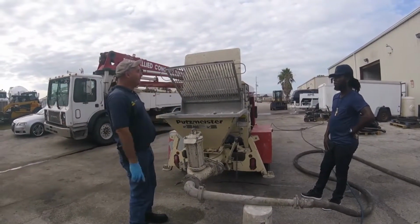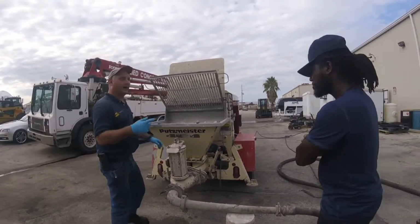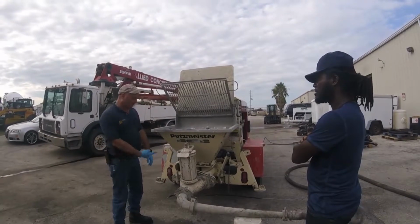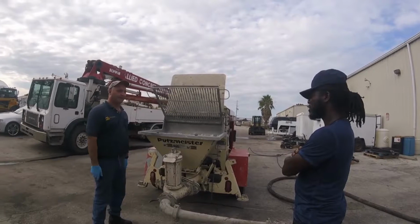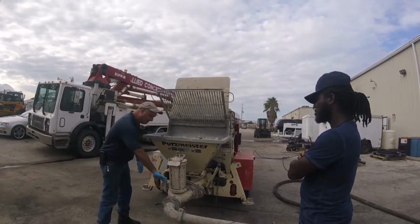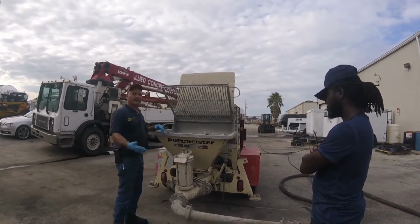You're going to see it. Most of the time it's going to be clear. Okay. If you get a tighter mix, or if the driver puts a lot of water in the hopper, sometimes it'll get minky up there. You just give it a good rinse, reach your hand up there, grab it, clean, boom. Okay. Put it back together, put your sponge in there, fill it back up, and then you push your line. Okay. Throw it all in the truck and you're done, just like your 305.